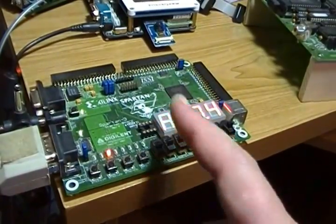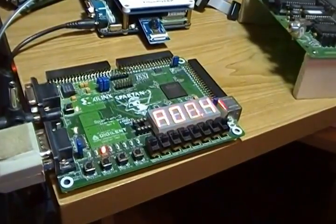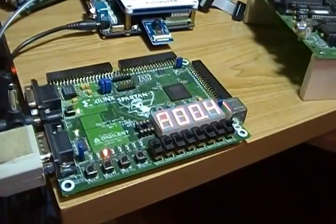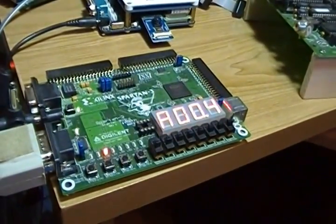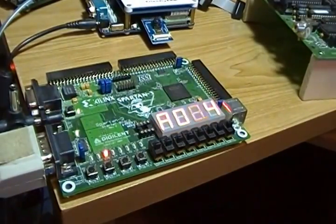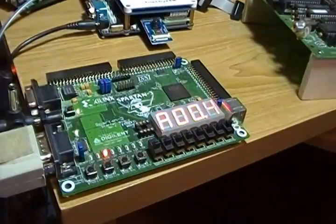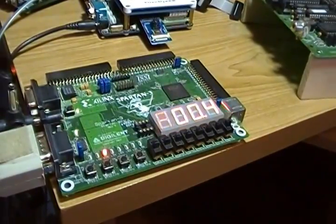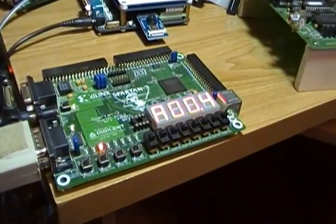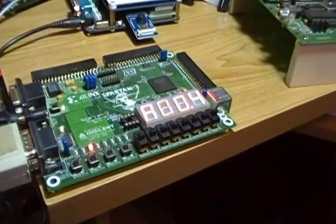One neat feature is that when you're depositing into memory, this serial port will just take a raw dump. Most of the time, I'll bootstrap it through the serial port to what I call BlueMon, and then I can use a serial terminal to interact with the board — examine memory, set memory, and more importantly, load Intel hex files which the cross assembler will generate. So anyway, that's Blue, based on the Caxton Foster computer of the same name from Computer Architecture. It's a very novel front panel. Thanks for watching.